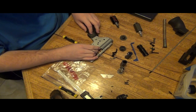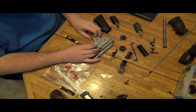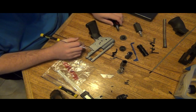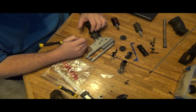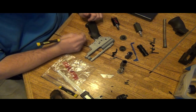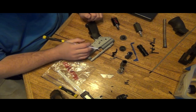Then once you get to that point, you could take this all apart, take off that 0.1 millimeter and put it on the bottom, close her up, and now you don't have to worry about adjusting this any more. The reason for that being is because you've already got it at the meshing point. And you know that you don't need to go up or down because it's pretty much in the exact area, or we call it the sweet spot.